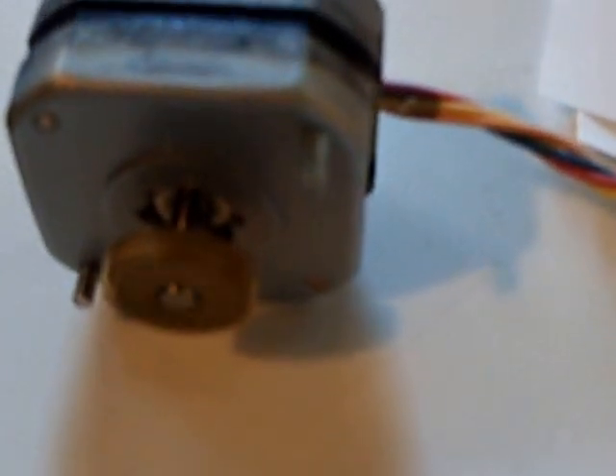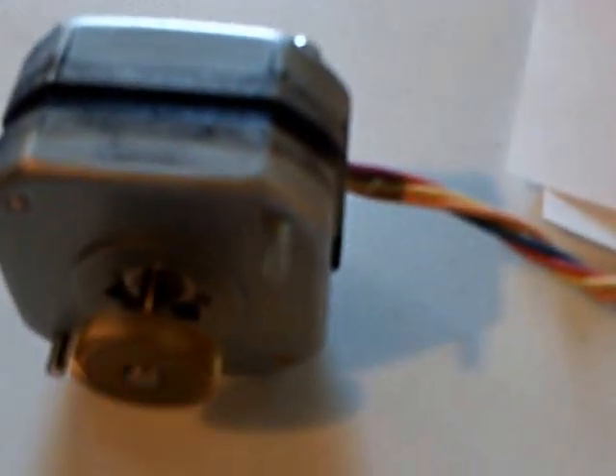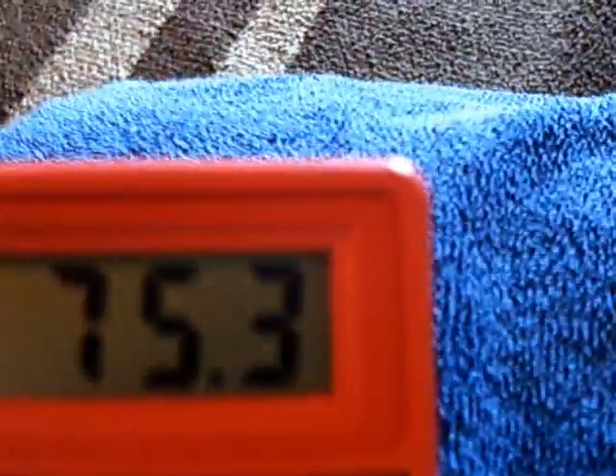It's flatter, but I thought this was really, really cool. This doesn't hardly make any noise now, if you notice. It's not running real fast, but this is what we're after right here, folks. There's your charging capability right there. That's the flyback of the collapsing coil field in that stepper motor, and I'm getting that using 75 milliamps on 6 volts. That's pretty impressive.